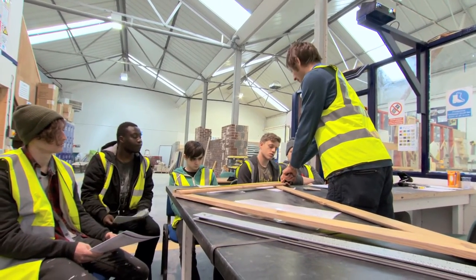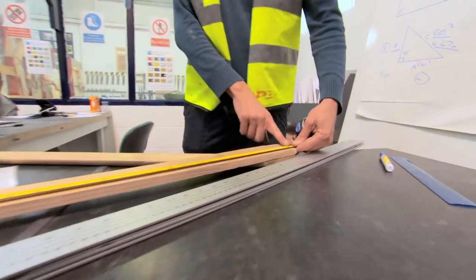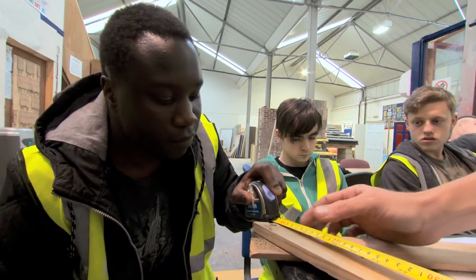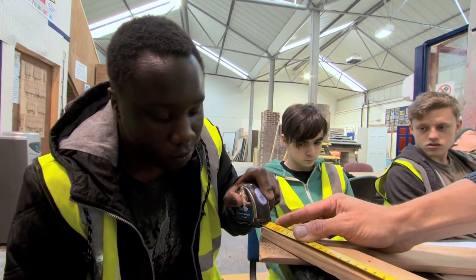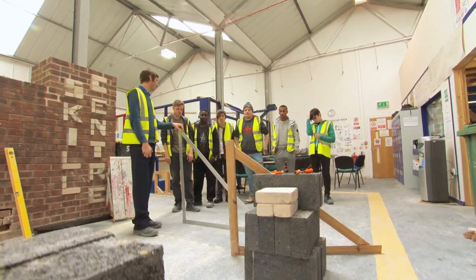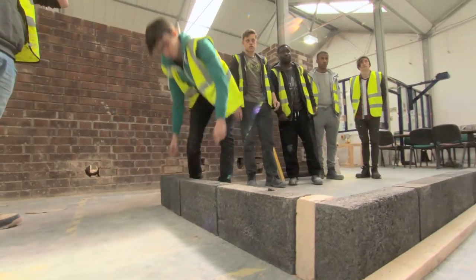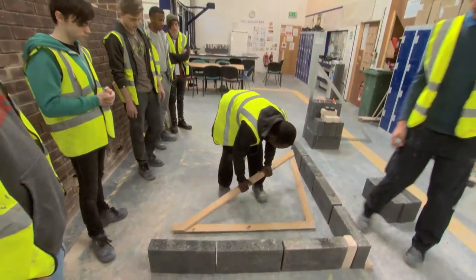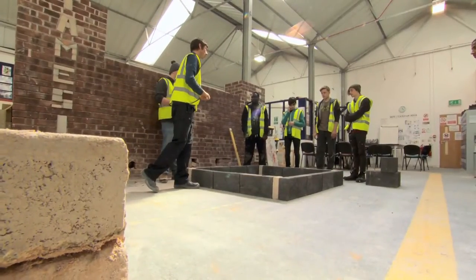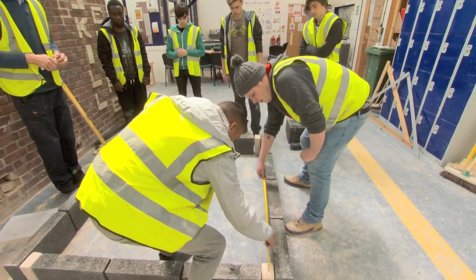One side's three foot — can you see that? The next side should be four foot, which it is. Take it down there to the point, move it along to that line. Five foot — that's it. Do it with the builder's squares first. To apply this principle in practice, the learners now have to build four walls for the base of an imaginary house. They do this using the builder's square. Now the learners have to check that the walls are at right angles to one another by using the 3-4-5 method.